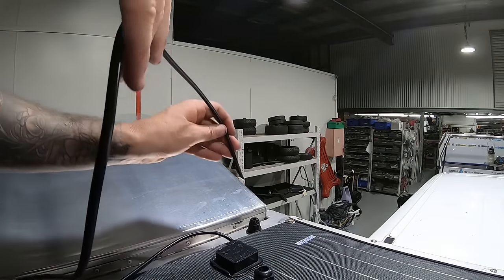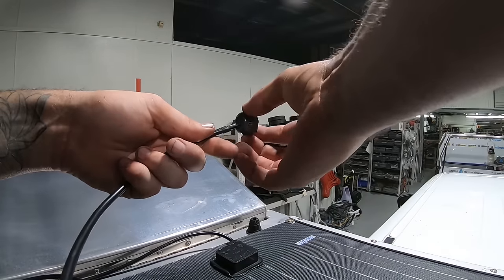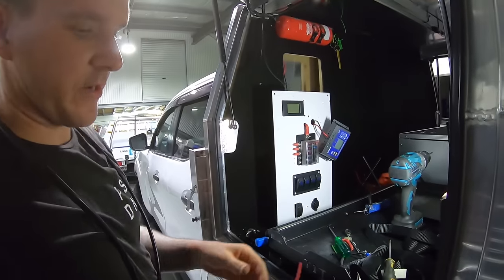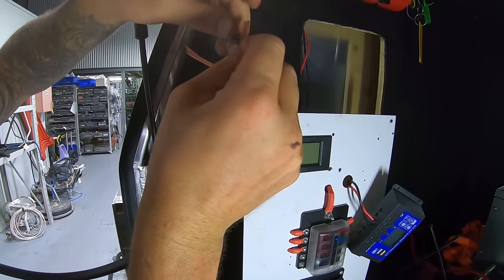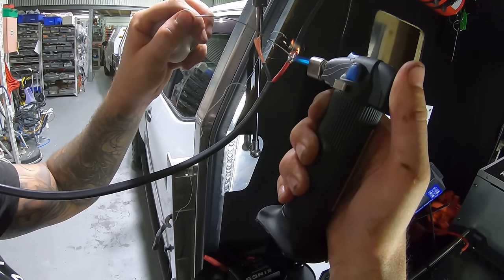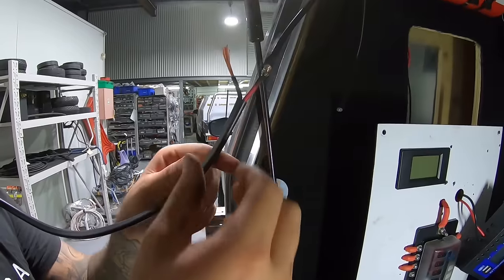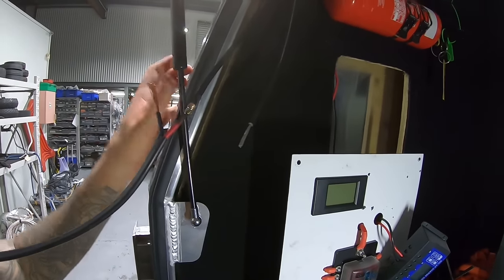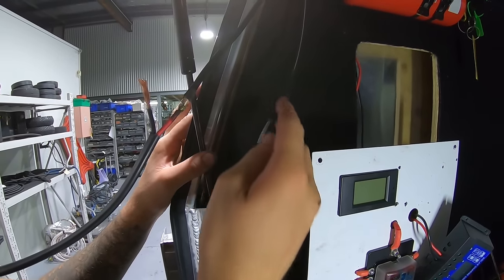I've put tape over the positive just to avoid shorting out, put down the gland — put the nut on first. I've taped up the positive wire; I've got these two spread apart so that when I do join them it's not going to short out. There's no way that's coming apart. You've chargrilled some of the wire but that doesn't really matter. You always do your positive wire first — that's so if your positive touches the frame, it's not actually a complete circuit because the negative isn't touching the frame.